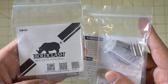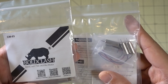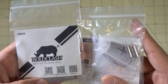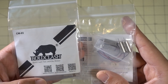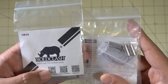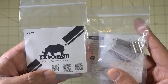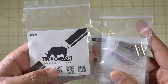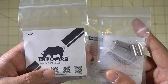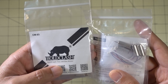We've got a couple sets of these 7mm 19,000 KV brushed motors. I think these are to replace the ones on the B03 series — so the B03 and the B03 Pro — and I think those have the 7mm motors but only 15,000 KV, so these should give you more power. Something like this would be a good upgrade if you want to do FPV and need a better motor to carry the camera. We'll be looking at this and see if it performs better with the FPV system on top.